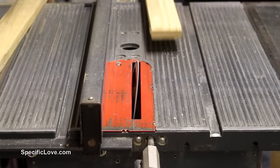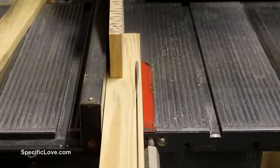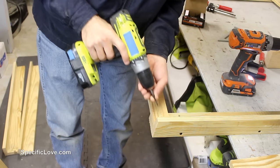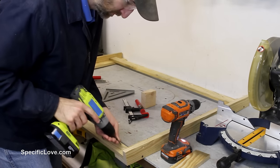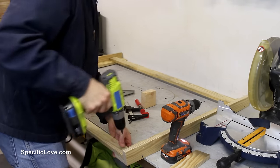For the top of the frame, each of the pieces needed to be cut with an angle. For the front and back supports, I had to rip them down on the table saw at a 10 degree angle. For the back legs the top support had to be angled inward, but on the front legs the angle had to be facing outward. I then screwed them to the top of each leg, making sure everything lined up.